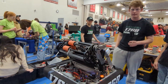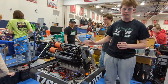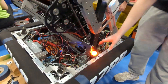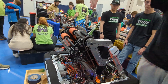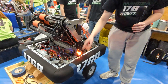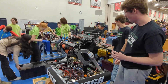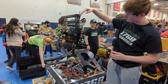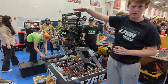You mentioned the ability to do the trap, but you don't have a climber on here. Right. For week zero, we've prioritized having functionality in our shooter systems. The climber is going to be a drum down here in this space that uses webbing to loop up to another drum or pulley with a spring that brings it up. We wind the drum down to bring the chain to this corner, so our arm can swing out. Then this loader is going to pivot out forwards, and this arm would be a little bit further forward, allowing us to get a downward shot while still pushing open the trap door.